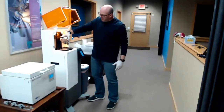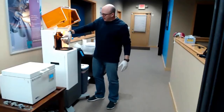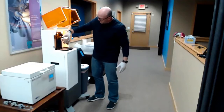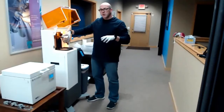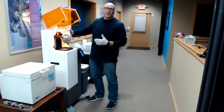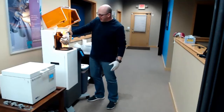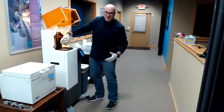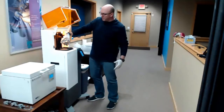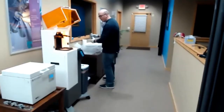This has been dripping overnight — I printed it yesterday afternoon — so now we're just going to get a little bit of the excess off. What you're seeing is this has some pockets in there, so geometry dependent, you may have more time needed to get rid of the excess print material at this stage. I had to break some surface tension by changing the angle the part came up, because it has some cavities that created a vacuum.